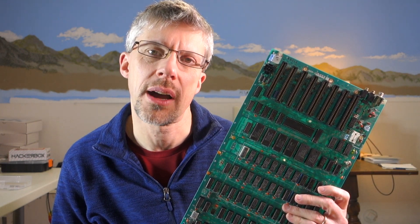In the end, it turned out that the problem Javier was seeing with his Saturn and booty cards was not the fault of the cards themselves, but it was actually a problem on the motherboard. And it turned out to just be a simple RAM swap to fix the problem. I'll have a link in the show notes to where you can download the Apple II Plus Diagnostics disc, as well as a link to where you can buy the booty card and the Saturn 128 card if you're interested. And that wizardy shirt I was wearing at the beginning of the show — if you're interested, just head on over to Javier's t-shirt store and I'll have a link in the show notes. And remember, if you haven't subscribed, please hit the subscribe button below. Thanks for watching.